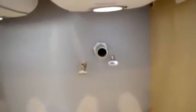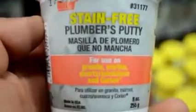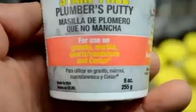Also, we have a single hole over there for a faucet. We need to make sure that faucet is installed correctly too, with the right hoses and everything. All these pieces here are combinations. This one is the set for the T that is going to connect the two strainers to the drain. Also a trap. A trap keeps water inside to avoid smells from coming out of the sewer line. And there are other little elbows and extensions, because if you take a look over here, we have the drain, called a little offset. You want to make sure that it's connected properly, so the two drains drain towards the hole. So that's what it is.